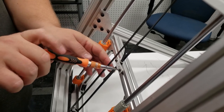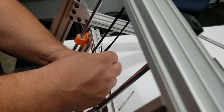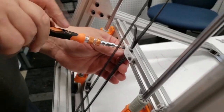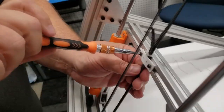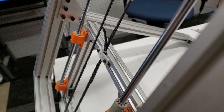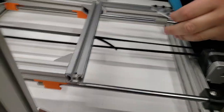The final step is to install the belt. You're going to use a small bonding plate — linked in the description — along with a couple of T-nuts. Once you've looped the belt all the way through, zip tie it and attach it with the bonding plate. Then trim off the excess belt, and you'll have one complete y-axis ready for action.